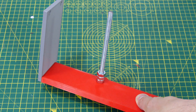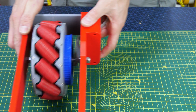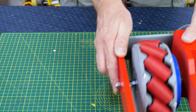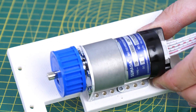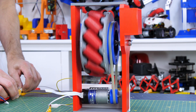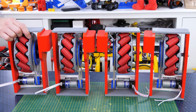Here's one side of my foot and the wheel slots in just like this onto some 8mm studding that's bolted onto each side to help hold the whole thing rigid. If I slide that foot around we can see that the mecanum wheel turns when I move it sideways and backwards and forwards, and that explains how a combination of these motions makes the droid omnidirectional. For now I'm using some pretty small 6V motors with gear heads — I've used these in quite a few projects and there's quite a lot of choice out there for similar motors. So with a belt drive onto the mecanum wheel that seems to run okay, just running that on a 2S LiPo. And yes, of course we need four of these with opposite pairs of mecanum wheels for the whole droid.